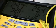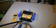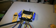It's also a cool thing to have when you have the HVAC guide with the sman4. Let's say you think you have a TXV issue inside the house. Well, once you sync your HVAC guide with the sman4, you can go inside and make changes to your TXV, or you can unwrap it, see the temperature changes, put your hand on it, see the temperature changes, see the pressures change from your HVAC guide. Now, of course, there are other ways you can find out whether or not the temperature changed naturally. You measure the actual line temperature coming out of the evaporator. But to have this to kind of verify, it's a cool tool to have.